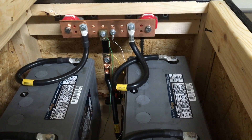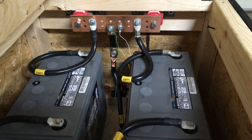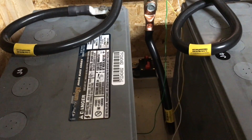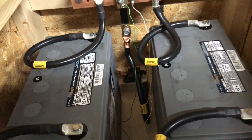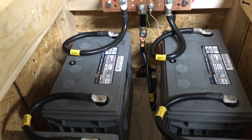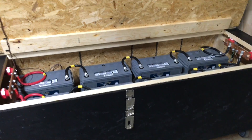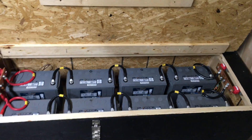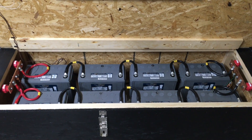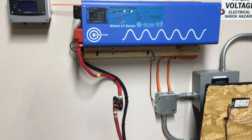It's a 100-amp shunt, which should be enough — load tests have never shown it pulling anywhere close to 100 amps, and I don't think it's come close to 50 amps. There's also a DC battery breaker for the negative terminal inside the box. The positive is kept outside the box, which has a lock on it to prevent prying eyes, tools like screwdrivers or hammers from accidentally making contact, and to allow safe maintenance by completely disconnecting the batteries from the system.